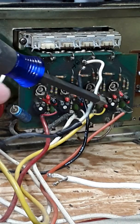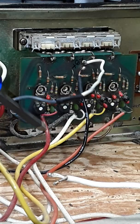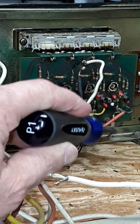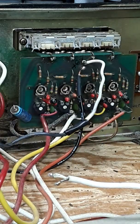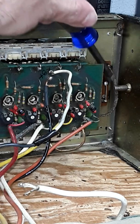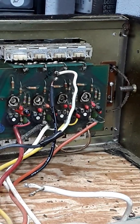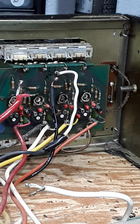This up here is a not so nice repair. I don't mind wire splices, but I hate electrical tape. But anyway, so that's the point. And then underneath here, you can see this is a lighter gauge wire down in here. That's of the bad insulation, and that'll crumble with any sort of flexing. Yeah, this wire here to the side lights is shot as well, so you can see it just flakes off. All right. So here's a close-up. Good stuff right here. All right, no problem.